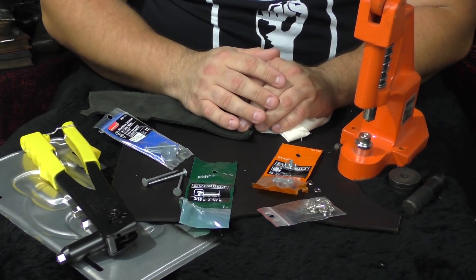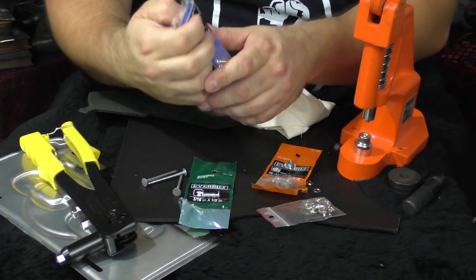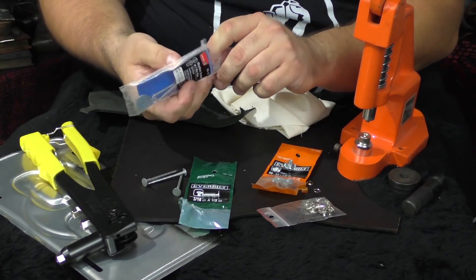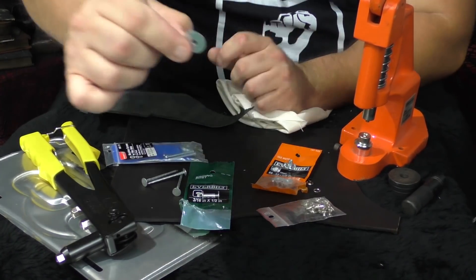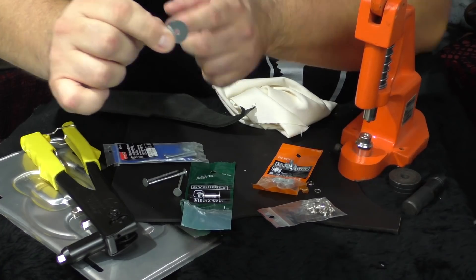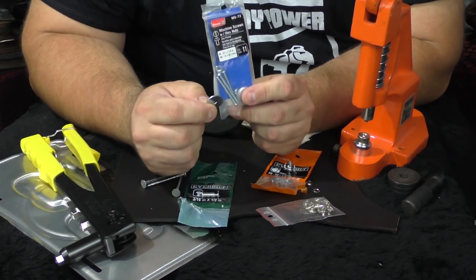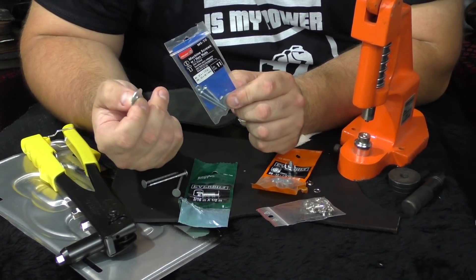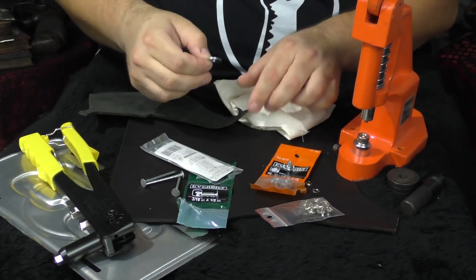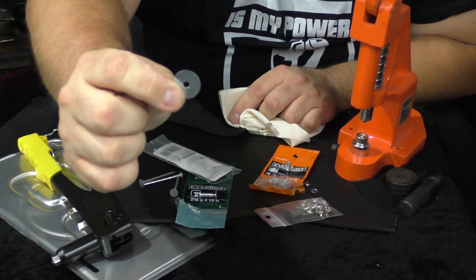You have your old standby: nuts and bolts and washers. There are videos on screwing stuff together, but I'd like to add to that. You should consider and definitely use fender washers. A fender washer is just a washer with a larger outside diameter, so when you are bolting or screwing stuff together it's going to make it a lot harder for that bolt or screw to rip out, because it has to rip out something this size as opposed to just the head of that nut.